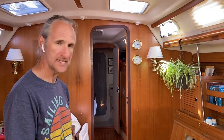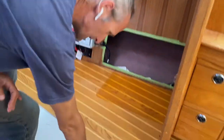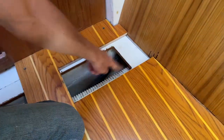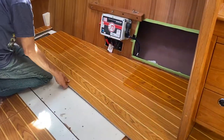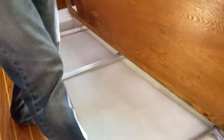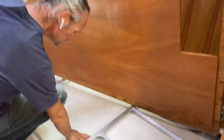I'm going to show you what has happened on the boat so far since we started. I pulled this panel up here — I cut down the line so we'd be able to access the ports underneath. There's a tank access port here and one here, and I put this in so we can access clamps as needed, because once the battery is in it'll be a pain to pull this all up. Underneath the subfloor covering the tank, they created a lattice structure to support the floor over the tanks, because these are really heavy batteries — 140 pounds each. There are going to be two batteries here and one battery over there.